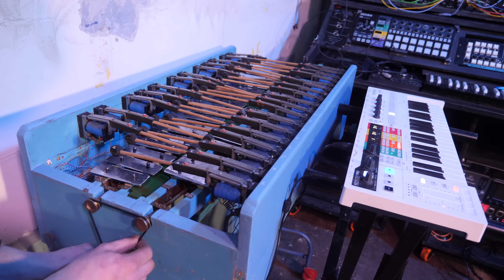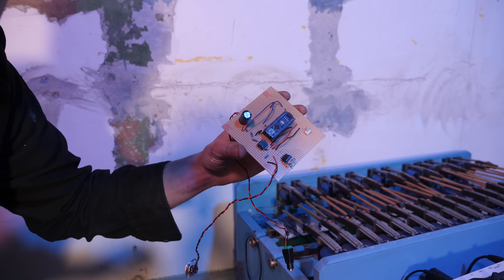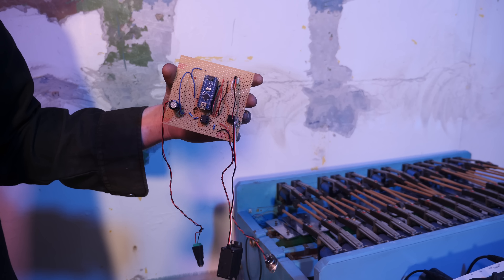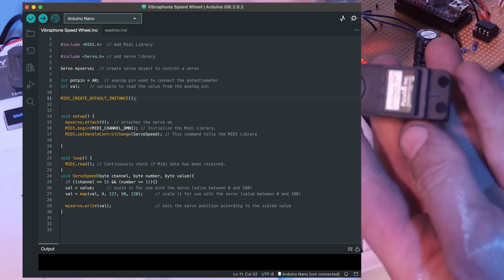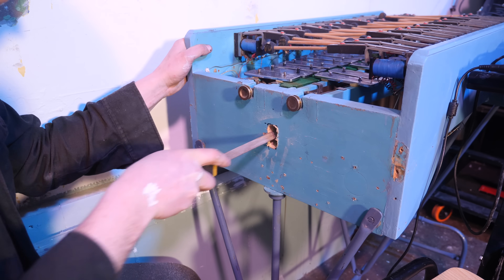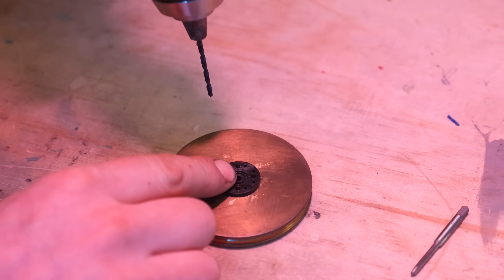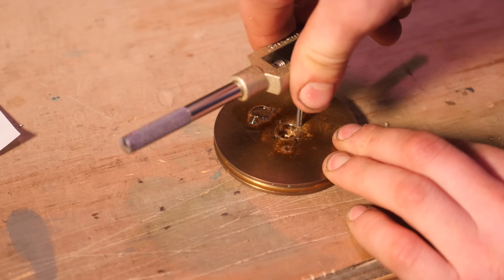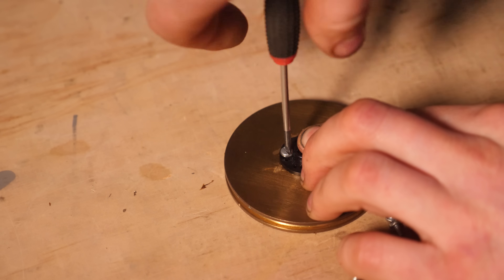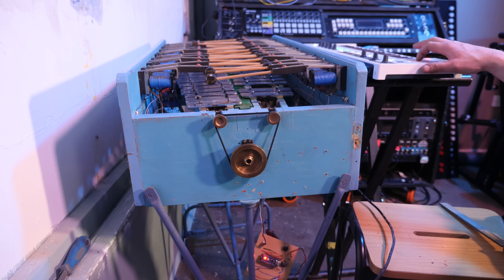That vibraphone mechanism sounds lovely! I made a motor controller out of an Arduino with an opto-isolator, so you can plug a MIDI cable in. Search up 'MIDI input Arduino example' — I bashed together a bit of code that lets us control a servo with the modulation wheel. There's a link below in the description to that code. I'm cutting a hole to fit the servo in. I took the original brass gear and tapped some M3 screw holes so it fits to a servo mounting, then attached it to the servo and put the belt over it.